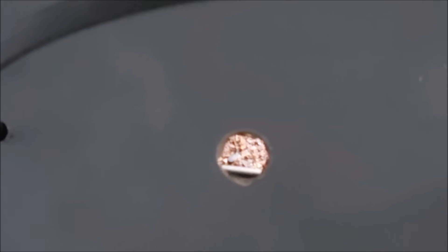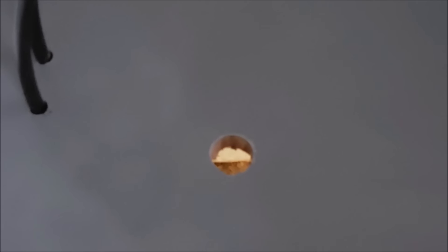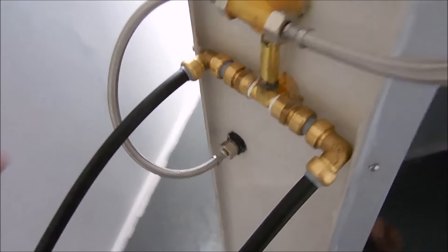I've drilled the drain hole there — you can see that pipe just running under there through the hole, it's just not connected to anything yet. I'm going to have to use a flex drain to get to it. Where that hole is drilled is the center once the shower is pushed back into position, and that's where I'll run the drain to, to avoid that cross member I marked on the floor. I'll be using a flexible drain and hopefully it'll do the job. I'm a lot happier using the braided line and I've connected that all up.